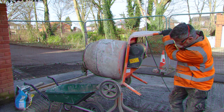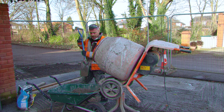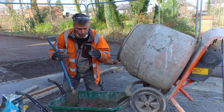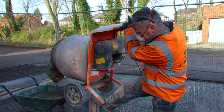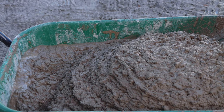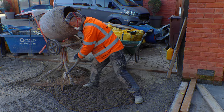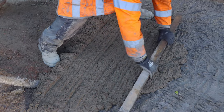That is a really good strong concrete mix — four of the ballast and just one cement, which gives you a really strong thin slab. However, if this was going to be the foundations of your house or garden wall it can be a little bit weaker, and that's where the six to one ratio comes in — you'd add two more buckets of ballast to this mix. The other important thing to make a strong concrete is to get the air out of it. I use the edge of the shovel to spread it around, which helps keep the thickness consistent throughout the area, and then take your plank of wood and tamper it down both ways. The more you tamper, the more air you draw out of your mix, making it more dense, thinner and stronger.